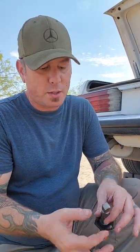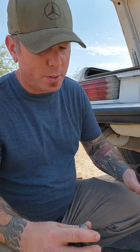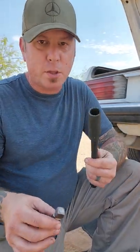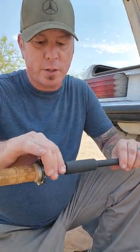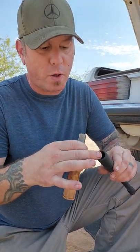Since this is a wasted part anyway, I got a bolt extractor — it's an EX-7, 17/32nds drill is what it says on it. It's very large on the end, a very large square. I found out that a 17 millimeter socket fits right on it — but it's the 12-point, so it's got the 12 points inside.